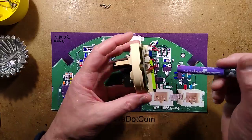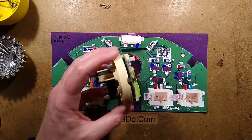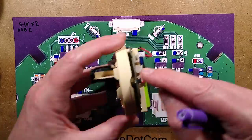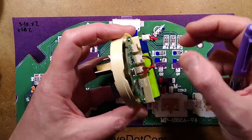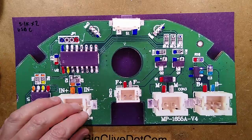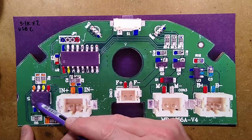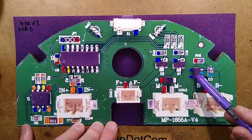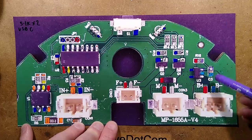It's also interesting to note on this circuit that it's all surface mount on top, but there is one surface mount component underneath - just an LED. If I plug this in, you'll see the LEDs do a little self-test - they light up brightly and then go out again. Each of those LEDs can actually do red, green, and blue, and they're all just in parallel with these resistors going to the chip. The USB port connection comes in here via a 0.1 ohm resistor. There's a TP4056 charge control chip charging the lithium cell.